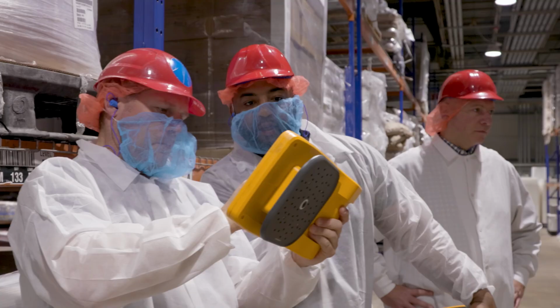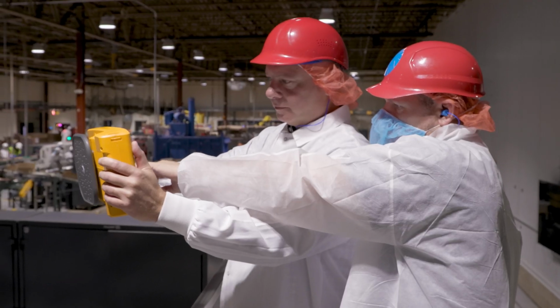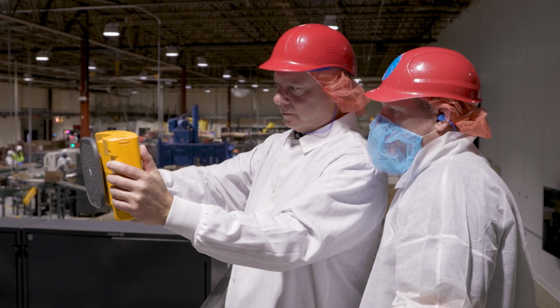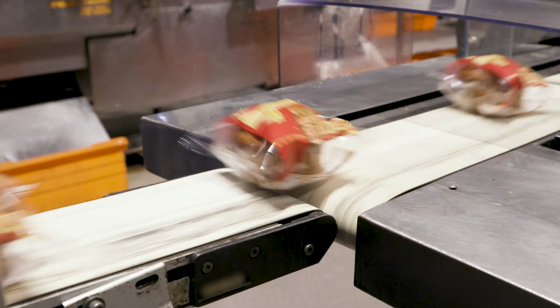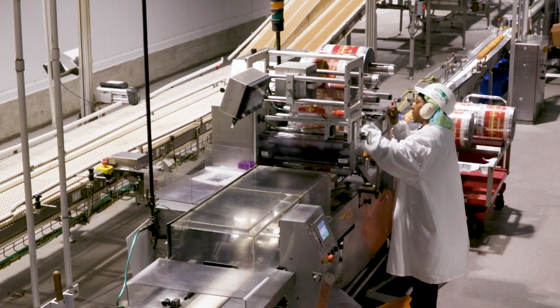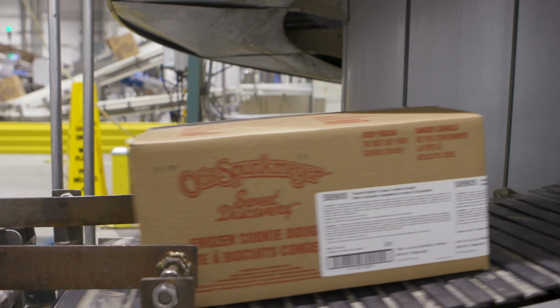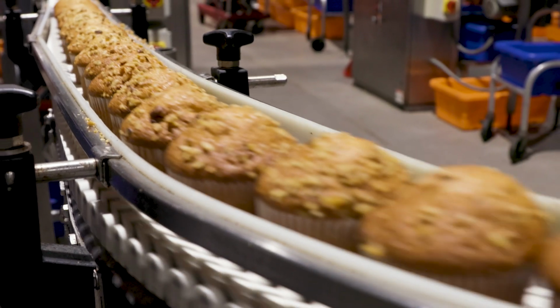First, we want to get a reading on how hard the compressors are running without making any corrections on the floor. And after we get that input, we go out, find the leaks, correct the leaks, and then go back and get another picture of how hard the compressor is running after the leak repair is completed, so we can see the amount of money that the company is saving by the job we did out there.